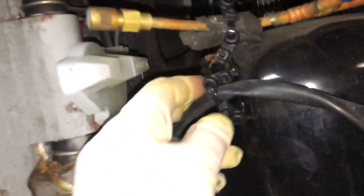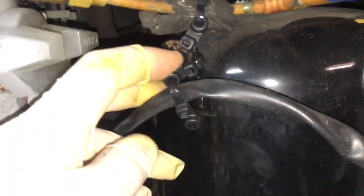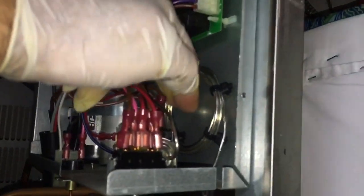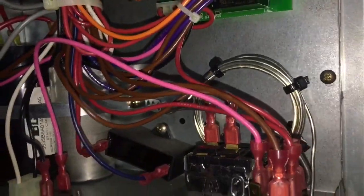Secure it here — one wire tie, two wire ties. I always double wire tie: one wire tie on, then move to the hole, and run the other wire tie to it so it's suspended. The black coating goes from there to here. Two wire ties on the liquid line, goes in. Then I do the coil up in here with four wire ties around it, so it doesn't touch the wall or rub a hole in the cap tube, and then stick it up like that.